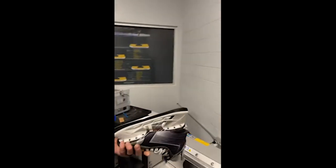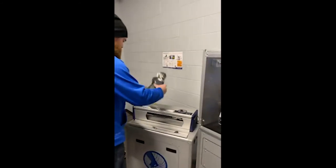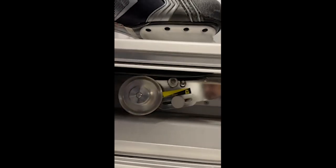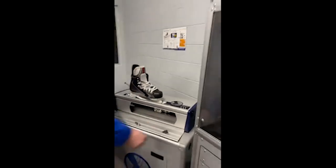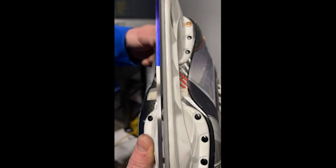My three cycles are done. I'm going to go back to the beginning and color the blade so you can visually see where that wheel is hitting. Hopefully I picked the right number of moves to see if it's perfectly centered or not. You can see visually that it's touching both sides there. It appears to have a slight angle to it, so potentially I might need to move it one more click to get it perfectly straight across.